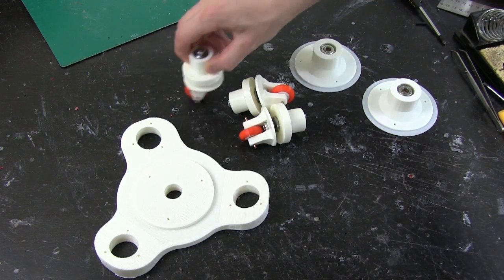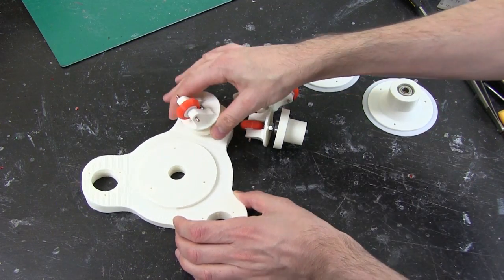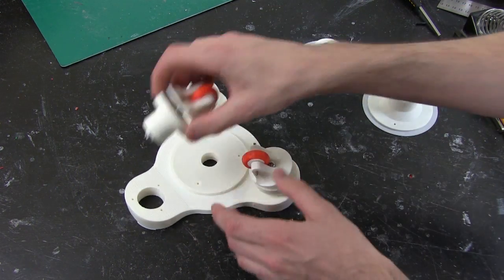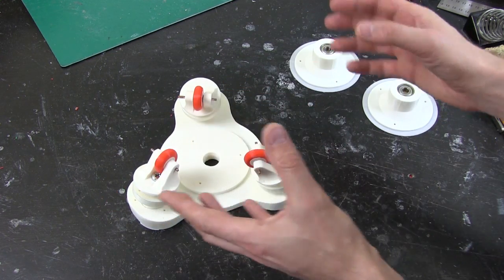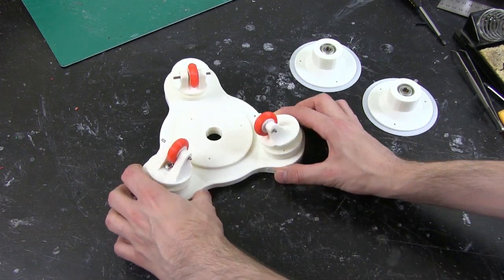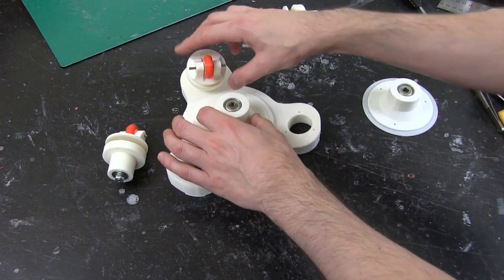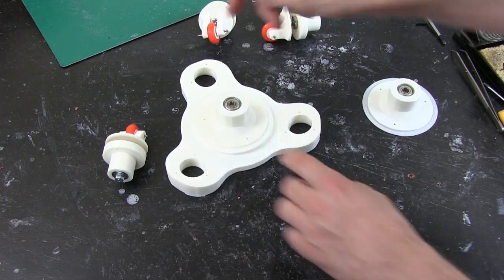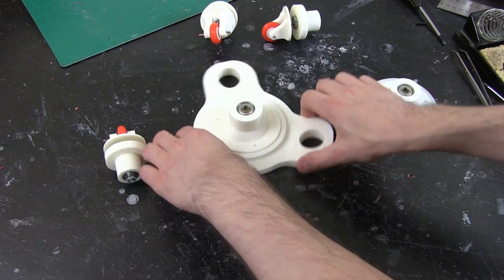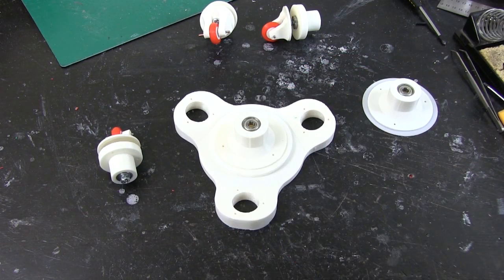So these work really, really well, and of course they fit in this plate and they're all angled in slightly. And these are going to get screwed in so that they all face in and match the radius or the circumference of the ball, all pointing towards the centre. Then within the middle of this, I've got this other piece which goes top and bottom, and that's got 8mm bearings in, and that's to allow the head shaft to rotate, or this to rotate around as it's moving but keep the head still. So let's put this together and I'll explain why that's important.